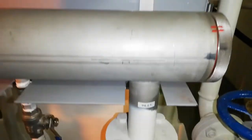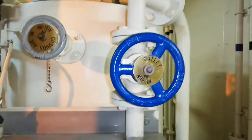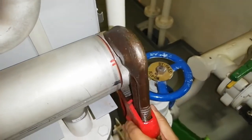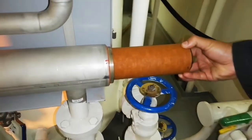The water will pass through the cartridge filter, then to the UV light, and then to the outlet. Slowly open the cup cover drain — water will come out. Pull out the cartridge filter.